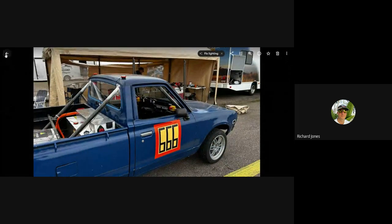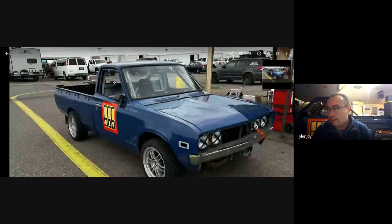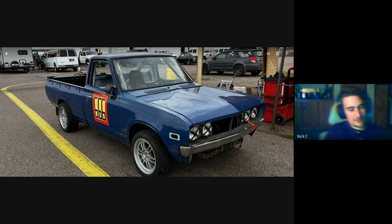I'm curious about efficiency. Yeah, I mean, wheel bearings and rolling resistance are definitely important, but it's a little awkward. We're not going to go buy Honda Insight tires and throw them on here. We have to have cornering speed. Sorry, just to chime in there, because there's a trade-off. You can decrease your rolling resistance, but then if you lose more speed in the corners, you're now increasing the amount of power you have to spend digging out of each corner. So there's some trade-off between sticky tires and EV tires, and quite frankly, I think there's a lot of testing that needs to be done there.